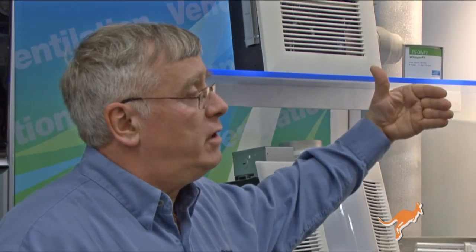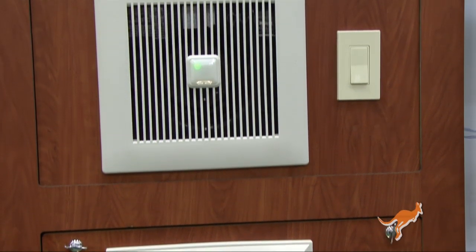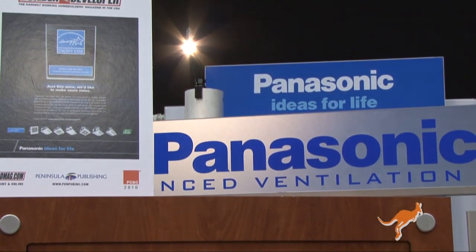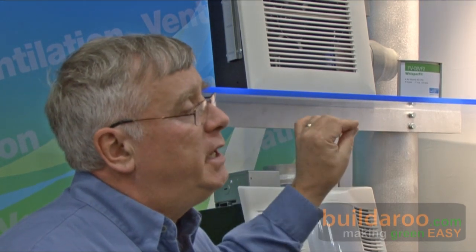These are really continuous circulation vent fans and bathroom fans. Quite often these are used as what we call a double-duty fan — used for whole house or whole building ventilation, the continuous low level. That's an air quality measure based on the number of people and the size of the house, typically around 30 to 100 CFM for almost all houses. These fans are designed to run at that low level, then kick to the higher level in the bathroom when somebody goes in to take a shower. On a DC motor like this — similar to an ECM motor — we can set a variety of speeds, and the wattage draw is very low, like 5 watts at 30 CFM, compared to 60 watts for a traditional bath fan.